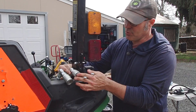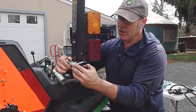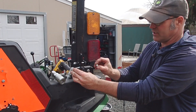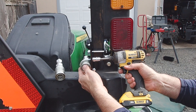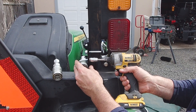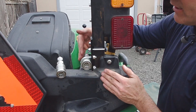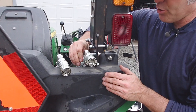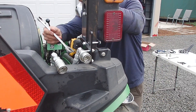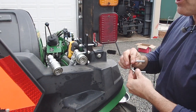To mount the couplers into the bracket, hold the coupler right up to the center and use a U-bolt right over the middle of it and slide that U-bolt through the bracket. Lock washer and nut goes on each bolt. You can tighten these but don't over-tighten them — if you go too tight this outer sleeve will pinch the inner part and it won't be able to spring in and out. So just a light tightening here. Before I put the second one on and cover up this joint, we had that note that said tighten before use, so I'm going to tighten it now with a 7/8 and 1-inch wrench. Repeat those steps for the second coupler.